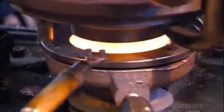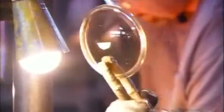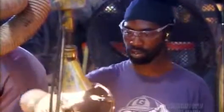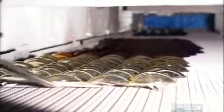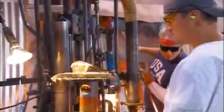This circular mold makes theatrical and landscape lighting. Again, a gob of molten glass is dropped in the mold and the plunger is depressed, forming the lens. Heat-resistant tongs enable workers to handle the hot lenses. Red and yellow lenses need a high-temperature anneal for the color to appear. This is called striking.